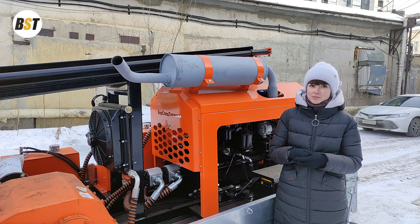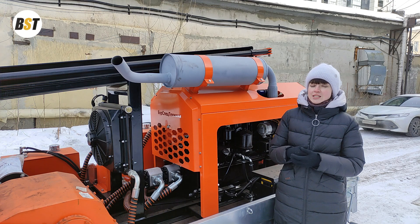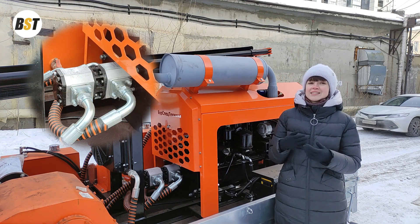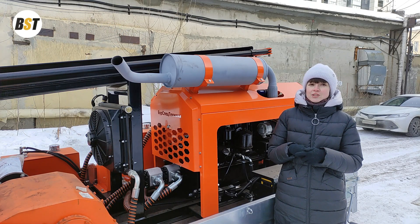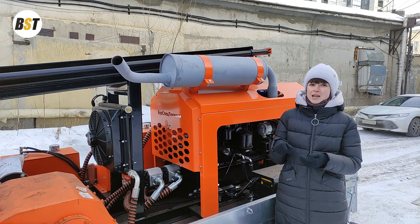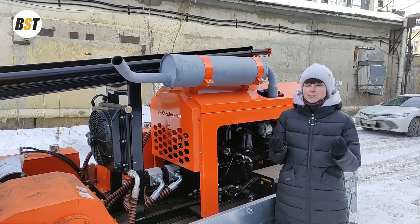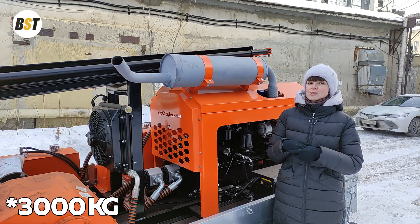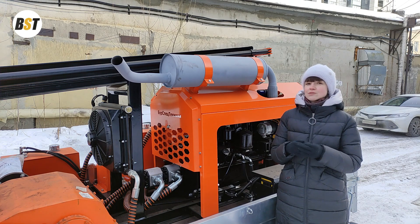Compared to other trailer-mounted drilling rigs, the GBU 60L has a double flow system of hydraulic oil provided by a double gear pump. This is a great advantage for customers, since the drilling rig can perform pulling down and rotation at the same time, making the drilling process way more effective and faster, especially in hard formations. Due to the weight of this drilling rig, which is around 3,000 kg, you can use different types of bits such as diamond crown, PDC, and roller cone bits to work in hard formations.